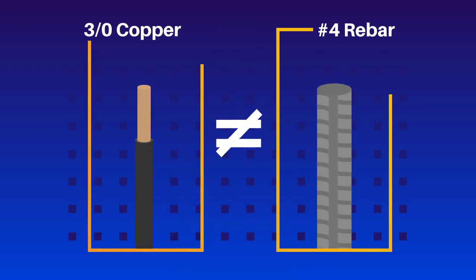The 2020 NEC also adds a provision that prohibits the use of the concrete encased electrode as a conductor to interconnect electrodes of grounding electrode systems. In some larger services, there could be a requirement for as large as 3-aught copper to make the interconnection, and a half-inch rebar has not been demonstrated to perform equally to those conductors. Therefore, that restriction has been added.